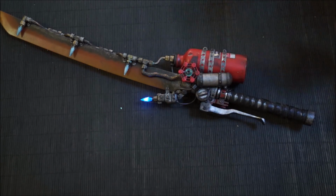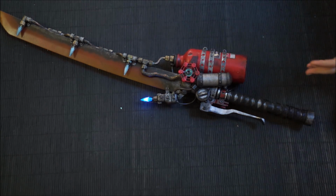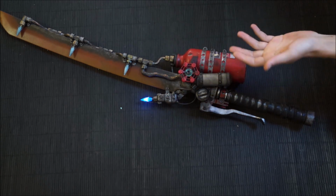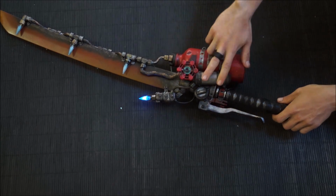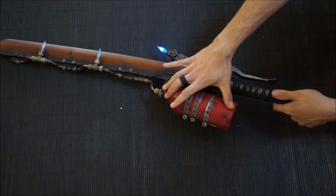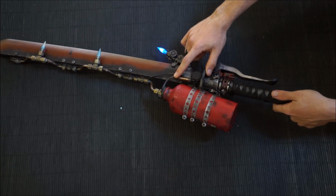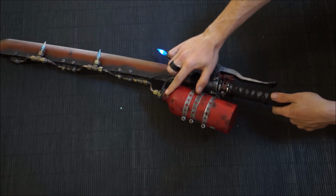This segues into the piping system. Now the piping system on this one has kind of 2 different configurations. The one it's in right now is when it's pumping a fluid known as aerosol or fog, and how that works is when this pump motor runs, you can see it runs up and into this main canister. Before it enters the canister, it runs through this aerosol generator. It's powered when the pump is on. This generates the fog and it pumps up into here.